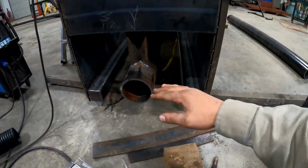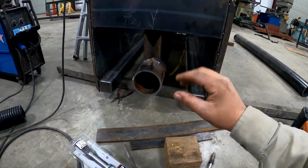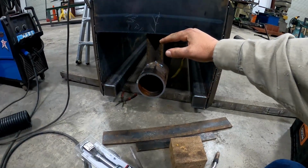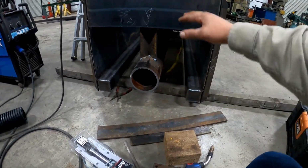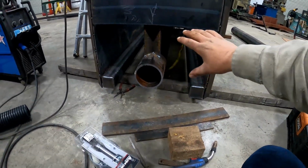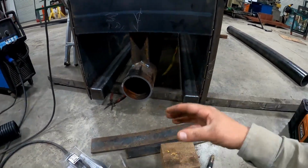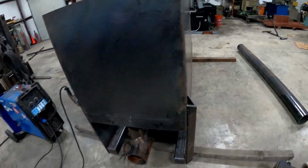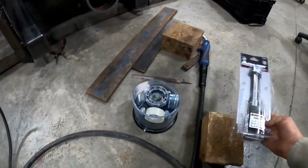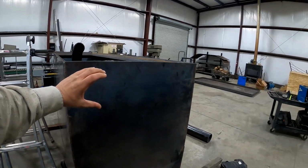at 11 inches to the top of the pipe. So there'll be 2 inches of 56 stone that sit on top, and you'll have a 13 inch overall height of stone in the trench. And then, once the excavator, we're gonna use this hub and spindle and mount a reel roughly right here